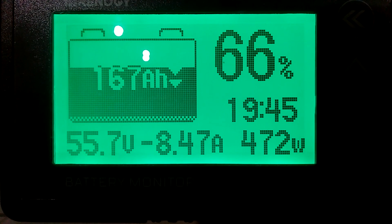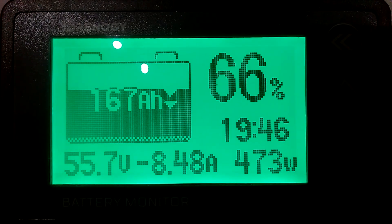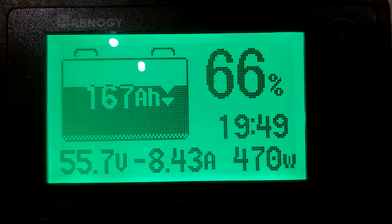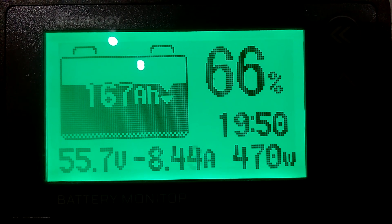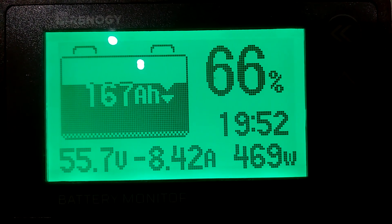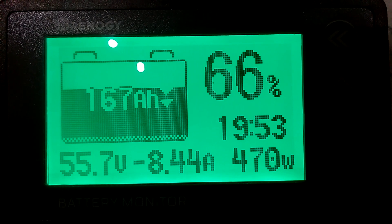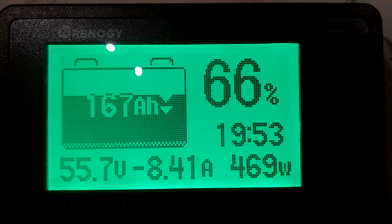When it reads empty, my battery will still be at like 49 volts. When I say empty, I mean by this gauge right here — when it gets to zero it will automatically transfer over to grid power. I like to leave the rest, from 49 down to 35, as reserve. The inverter won't let it go down to 35 — the inverter will shut down at 40. I like to leave that little extra power in there as a reserve in case something happened, so we'll have a little power that lasts till morning.